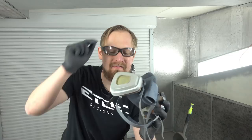And to all the Virgin Marys who think I will ruin my lungs, yes, it's a good idea to wear a respirator. A half mask is okay. You don't need a full face mask. The half mask has an A2 filter, and for the clear coat, an A1 filter with a P2 combination is needed. So that's more than enough to save the lungs.